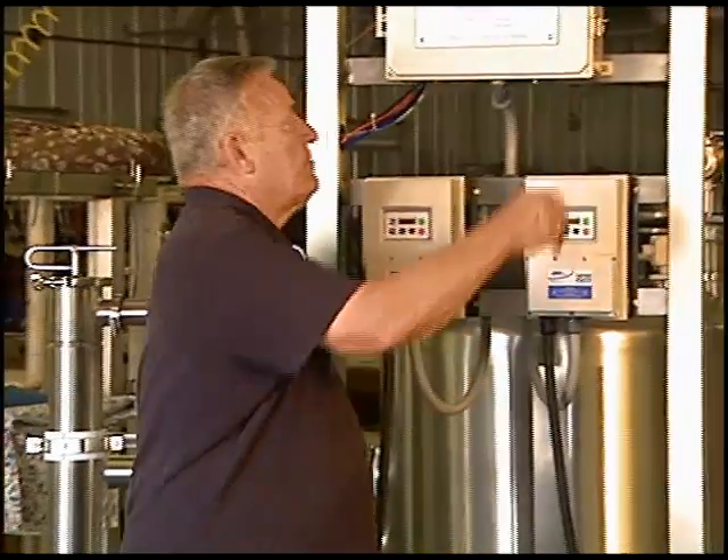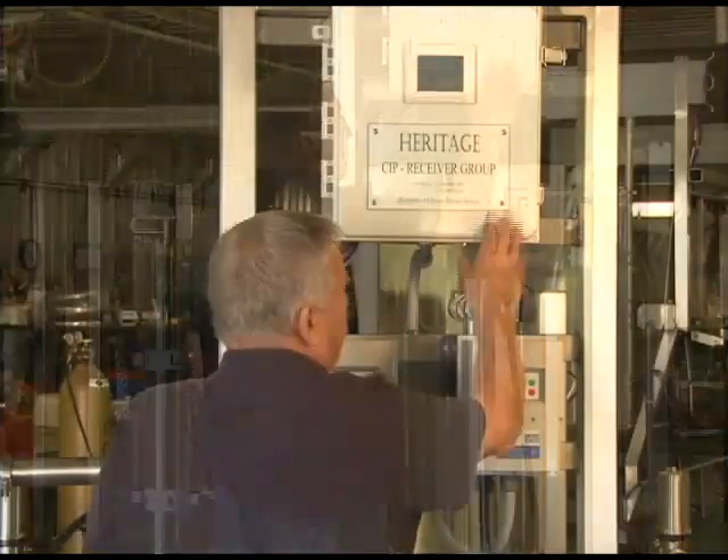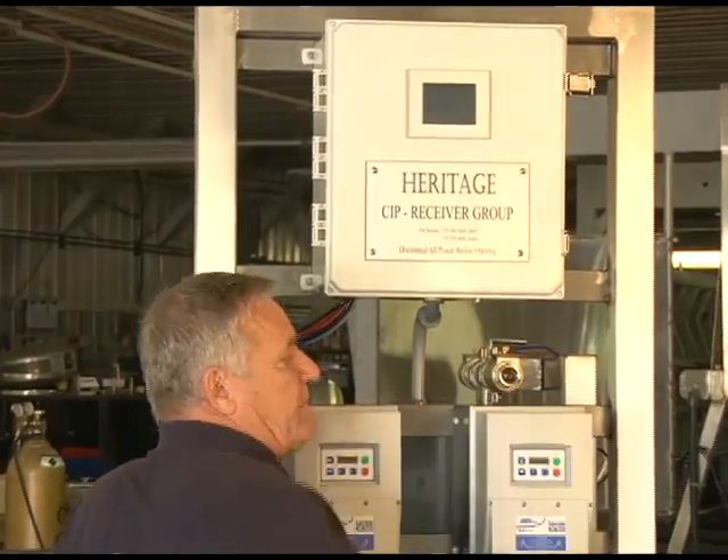First of all, there's the pipeline washer — Heritage Pipeline washer — the latest and most advanced washer you can possibly get your hands on nowadays. The fun part is that you never go inside to do programming. You throw a switch, the screen comes alive, and you simply change the seconds: air injector opens for so many seconds, air injector closed, detergent pump runs for so many seconds, acid pump runs for so many seconds, et cetera. Very, very easy to program.